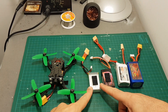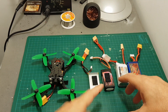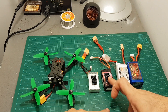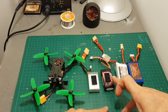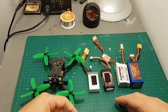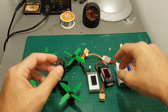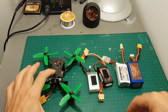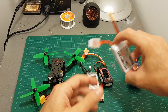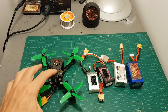The 2S is not recommended for advanced or even intermediate pilots. The 3S was the most successful, and you should get one with a higher C rating. Unfortunately I only had one with 30C available, as better ones are on the way. The ideal battery for this quadcopter is probably a 600 mAh 4S, and the one I used didn't perform well — so make sure to get a good quality battery.